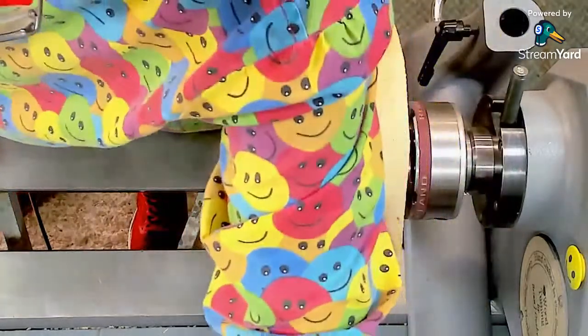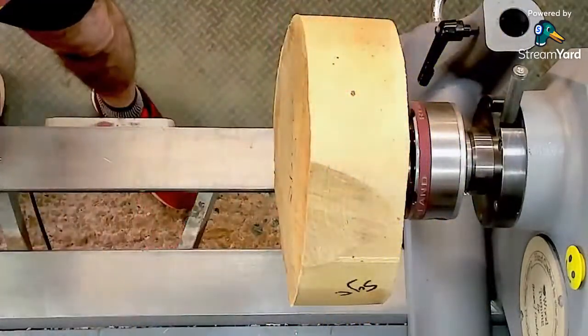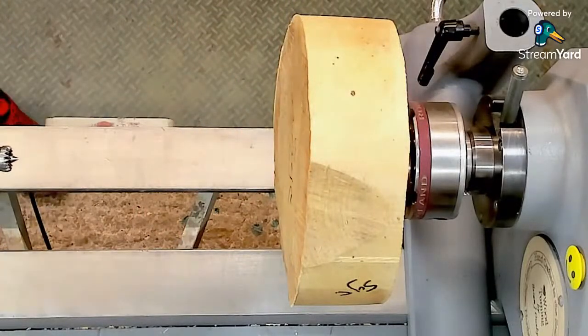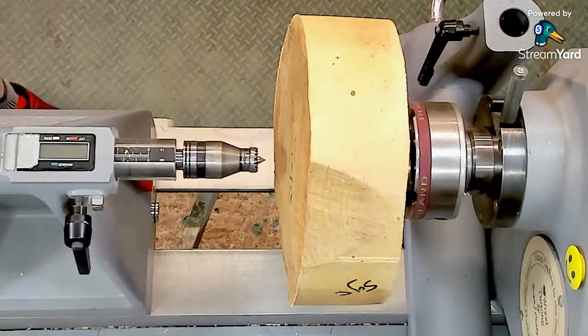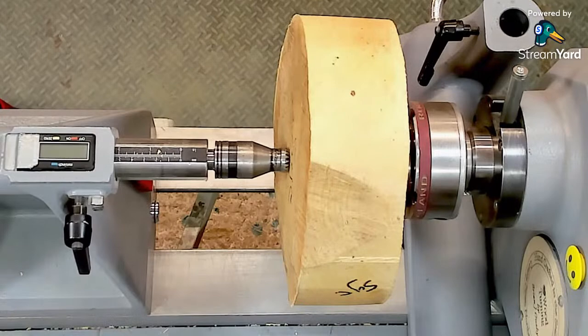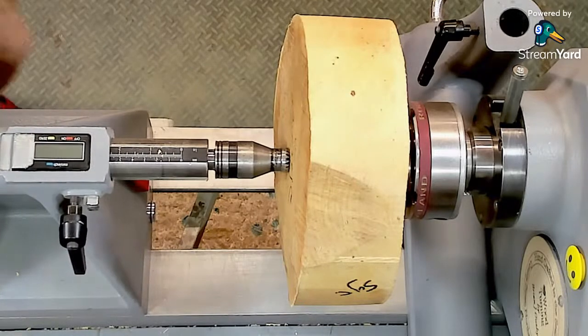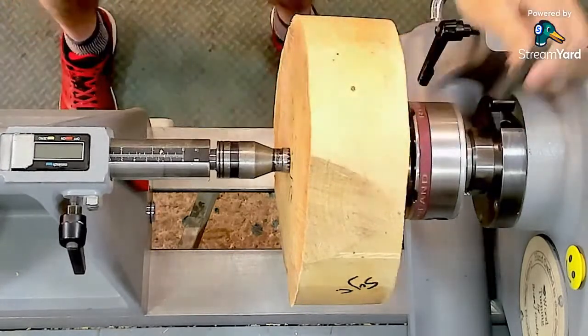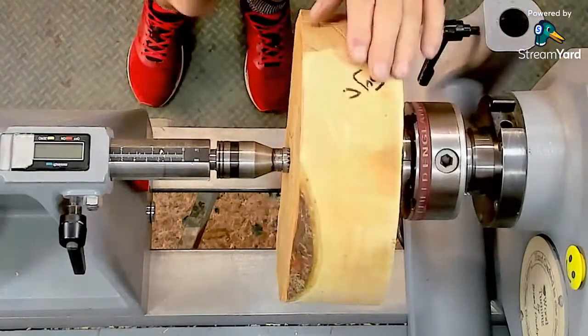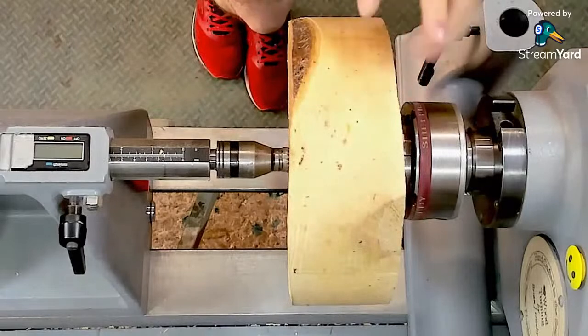And we'll bring up a tailstock just to be on the safe side, which will also give us a center mark in the middle. Put that in there. Wind out the quill a little bit. And this is a piece of sycamore, which is 3 inches roughly. You can see there that it's thicker in one place than a 3 by 4.5.